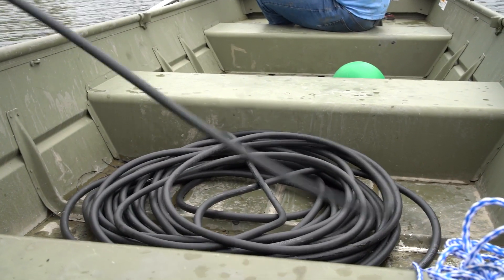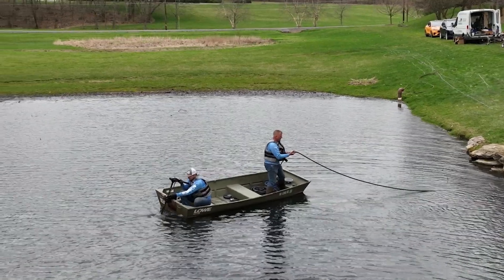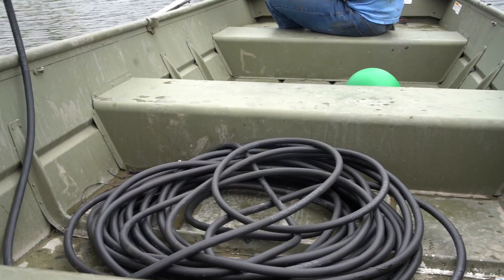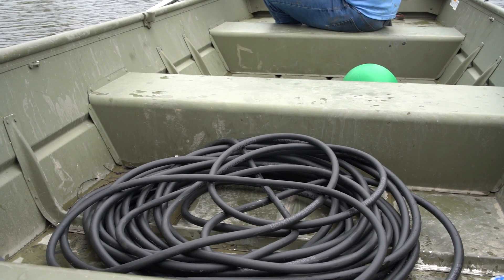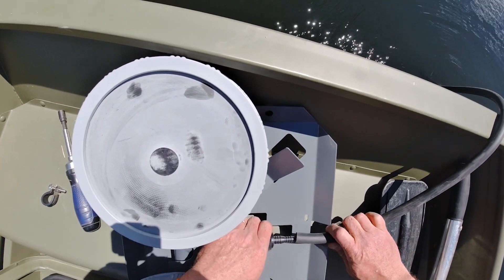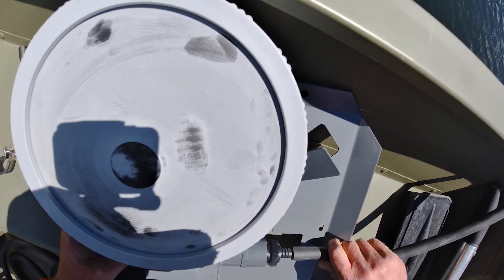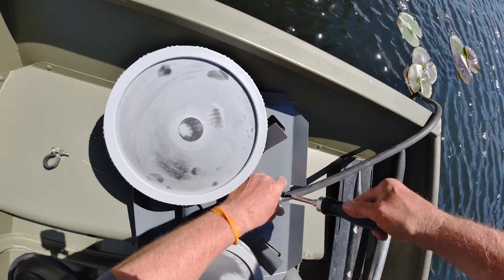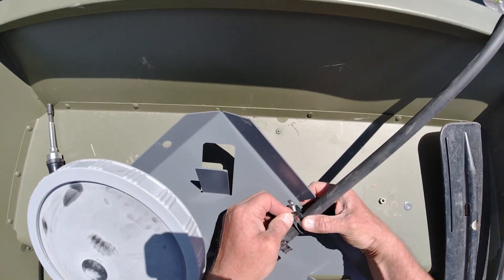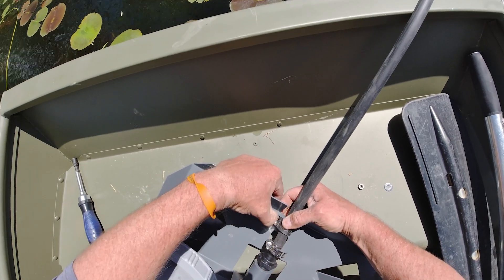It's time to install your diffusers into the water. Load the airline into your boat for your first diffuser — recoil the airline into the boat so it's easier to place into the pond as the boat goes out. Coil the airline into the boat, leaving the open end within reach at the top of the coiled pile. Attach the airline onto the threaded barbed fitting on the diffuser, and remember to add the hose clamp onto the attached airline. Then attach the airline to the diffuser plate using the C-clamp provided, which helps to reduce stress on the fittings.